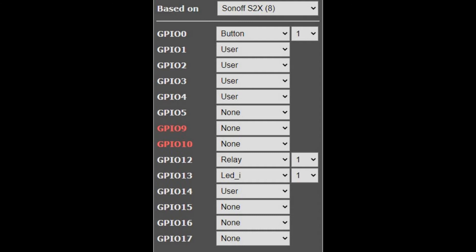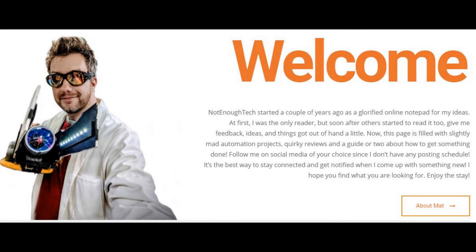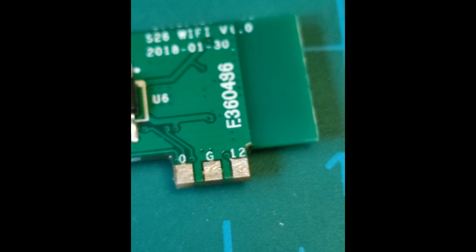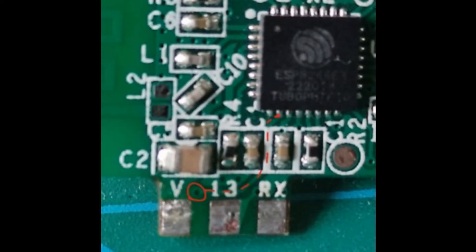I couldn't find a lot of information on the S26, but we do have the module configuration from Tasmota, which shows the relay on GPIO 12. This image from the Not Enough Tech website — Matt very kindly gave me permission to reproduce it here — identifies where GPIO 12 comes out. If you haven't seen the Not Enough Tech website or Matt's excellent YouTube channel, I'll leave links in the description below. So I took the daughter board off completely. The soldering on it was dreadful. You can see the pad for pin 12, and that goes off through a small via through the PCB and comes out on the other side near the voltage input pad. I apologise for the quality of the images — I'm trying to do this on my phone. This via then goes off on a track, runs underneath the silkscreen printing, and goes to pin 10 on the ESP device.